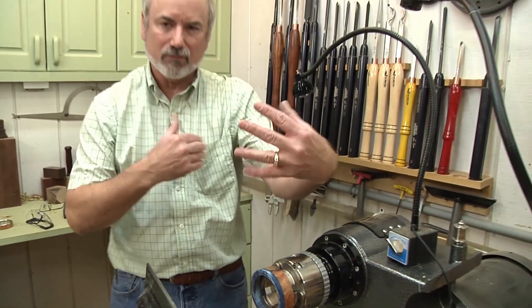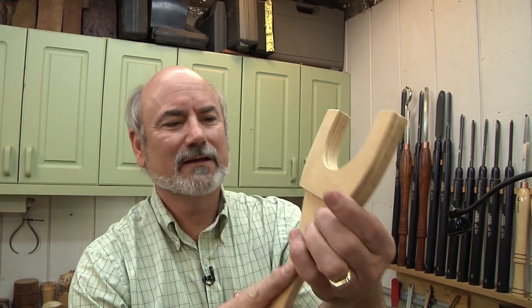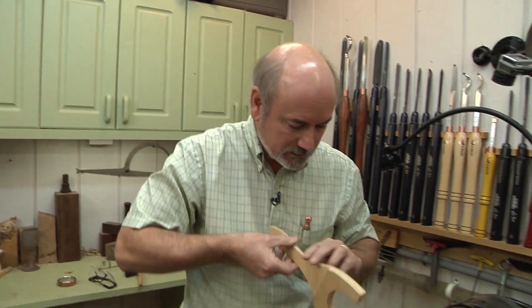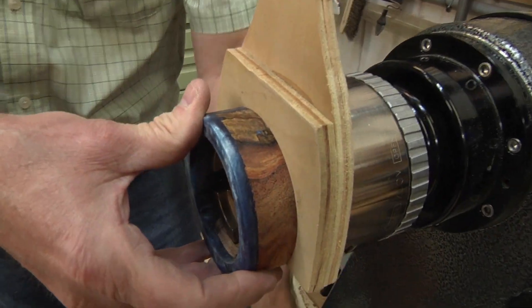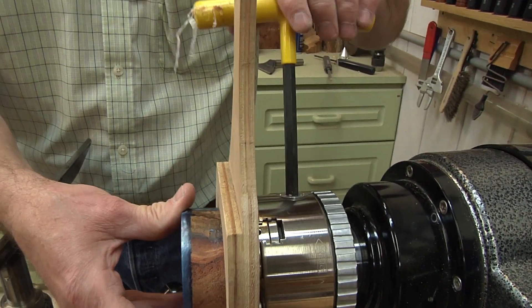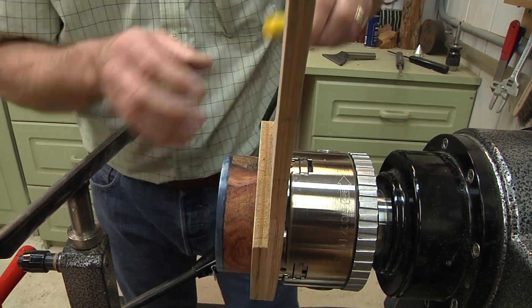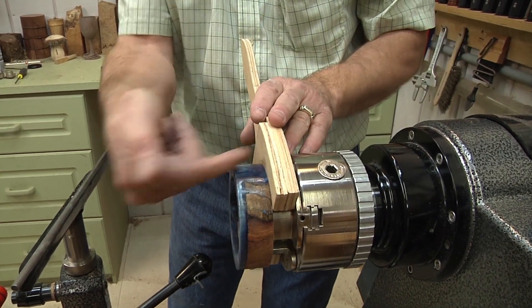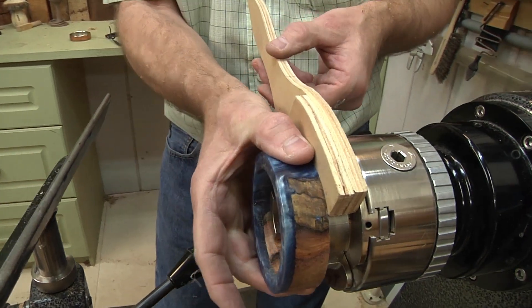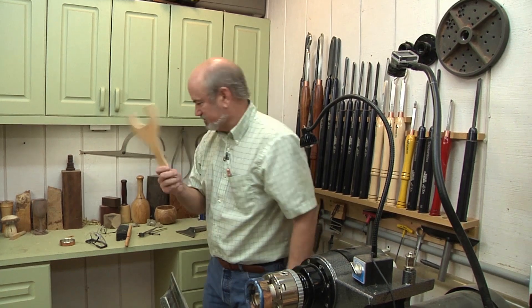How do you accurately get this on there? The bangle guy made one of these up. It's just some fiberboard or composite board, so it's straight - about a half inch thick to match with my jaws. What you do is take this and slide it over the jaws like so. When you bring this up, it's pushing flush almost all the way around. You open your jaws a little bit and expand - do this with the handle, not where you're doing the expanding. Now here's the trick: if you take this and spin it all the way around and it spins just right, that means I've got this perfectly flush. So when I start bringing this side in, it's going to match up really good, square, and fit on the bangle perfectly. You do want to take that off before you turn though, because obviously that could really hurt if it started spinning.